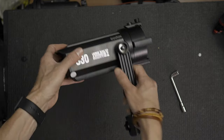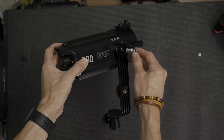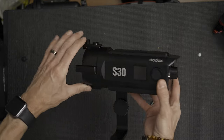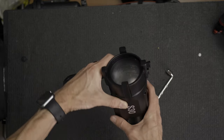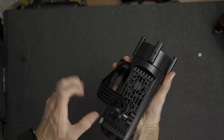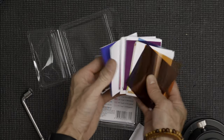The S30 itself is a very compact but mighty little light. The tension on the yoke is nice, and Godox includes three socket tools so you can adjust the yoke over time. On the back you have your power port and beam angle adjustment — you can go from six degrees all the way to 55 degrees. On the side is your dimmer knob. Inside you can see a huge COB LED, and Godox also has an additional mounting option on the yoke. Up top are the vents and on the bottom you have two fans.